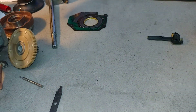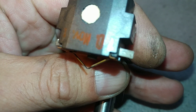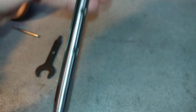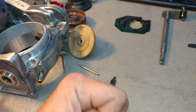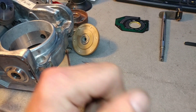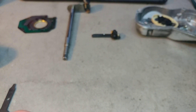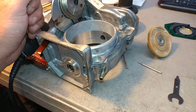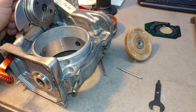One more shot of these brushes — you can see there's no bend to them, they're just totally flat. No good. It did work — don't get me wrong — but on the bench test it did shut off, and that is a big red flag. Once a unit is energized it's supposed to run continuously until power is cut off. This unit was running and then it shut off. I also checked the codes and codes came up for the brain — that's another red flag. You don't want to take any chances.